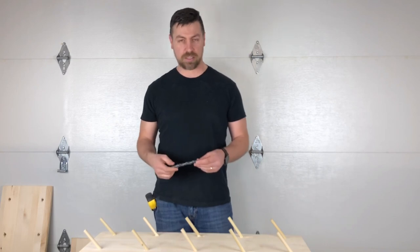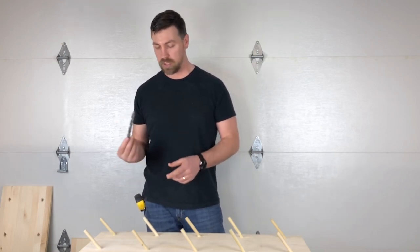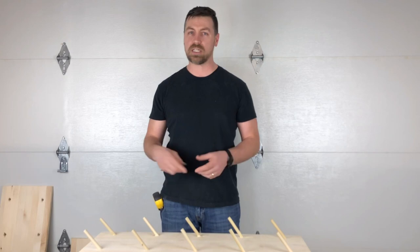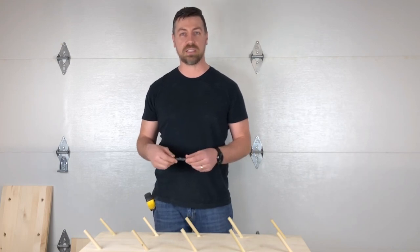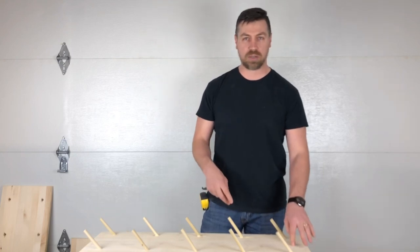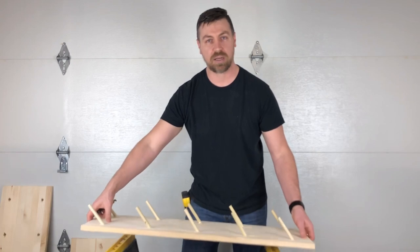After you've glued all your wood dowels in, you'll need to drill some holes in the board so you can hang it. Step up the drill bits just like before to get a straighter, cleaner hole. End with a half-inch drill bit, drilling about two inches down from the top and two inches up from the bottom. Hang it with a screw drilled into a stud — you'll need a stud finder for that. If you don't hit a stud, you can use a wall hanger — we'll put a link in the description. Put the screw in and tighten it down so it puts pressure on the board and prevents it from rocking back and forth on the wall.